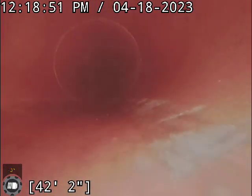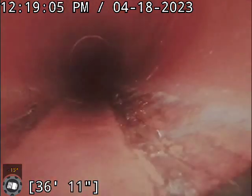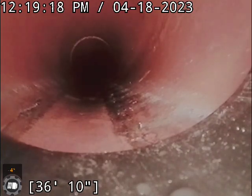All right, so we're pulling back. So this is roughly, all right, my footage is a little different from the previous plumber, okay? What happened is, you see, mine is gonna say 37 because he didn't reset it. See, I reset it once I went into the clean out, I reset my footage. So my footage is gonna be different from the previous plumber. He probably started from this point here. So this is about 3 feet from this point here. All right, now this is telling me that I'm at 36 feet.